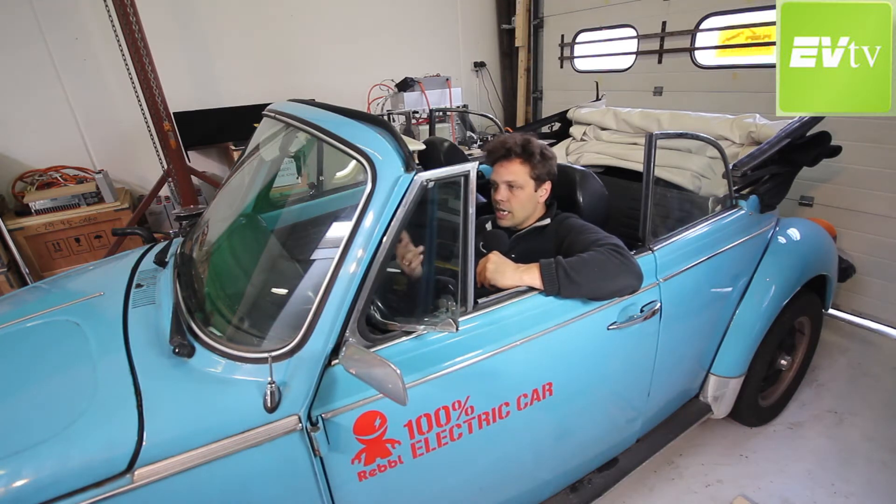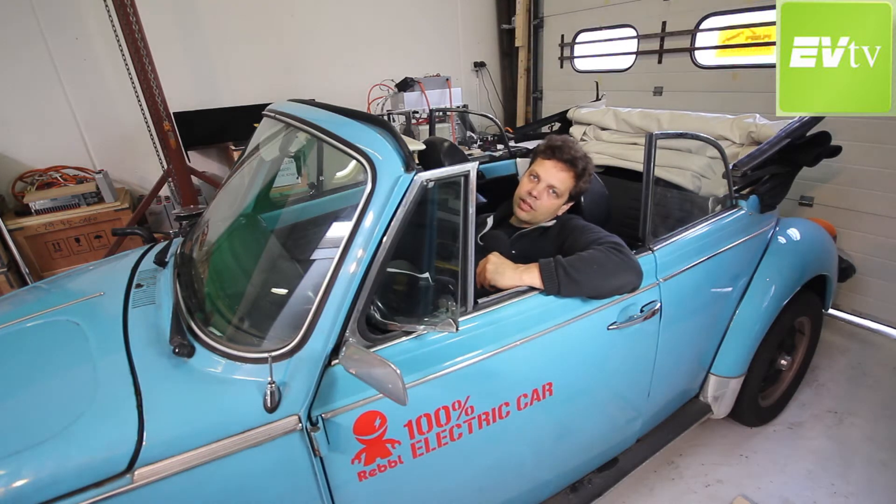The system voltage being 56 times 3.2, and the maximum charge voltage being around 195 to 196 volts. That doesn't seem to be the greatest idea. With taking apart the cells and making everything larger, we're going to have a hard time getting it in here.